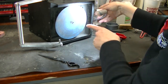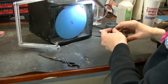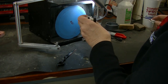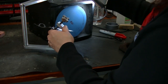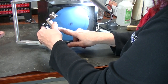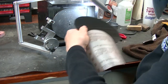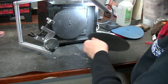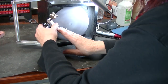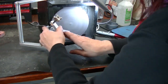This is 800 grit. I'm going to use my Swarf eraser, which is pretty ugly, and that kind of cleans it up and makes my pad last a little bit longer. What angle do I set them at? Let's do it at 40. They probably originally came from the factory at 45, but since it's blunter than 35 at this point, I don't want to take too much metal off — especially with that tip looking kind of iffy. I've got this in my clamp and I'm doing a slight rock to get the whole blade, but I want to be very ginger about the tip. Sometimes you need to get really aggressive with these and just get some metal moving. The blue film actually goes up to 500, but usually if I go anything more aggressive than 800, I'll switch to the 3M. I don't want to go too much here because this moves metal in a hurry, and I'm still not at the edge.